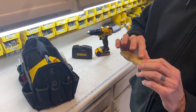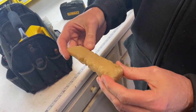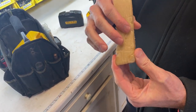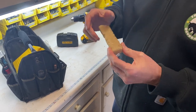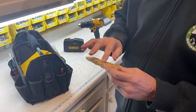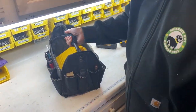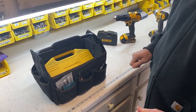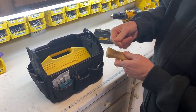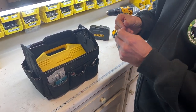This is some beeswax — some kind of wax — and it's really good for driving screws into studs. Sometimes you really feel it bogging down. So if you have screws going into any kind of hard material, it helps to lubricate the threads. I just drag the threads of the screw along the wax and it picks up just enough.